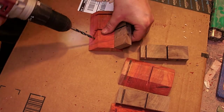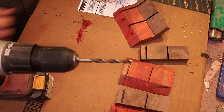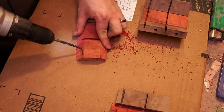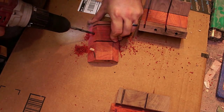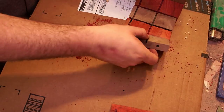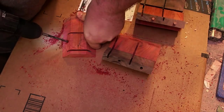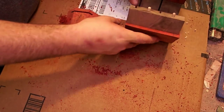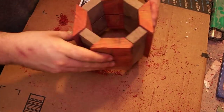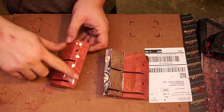Now that I have the slots and bottoms cut in all these little pieces, I can start cleaning them up and doing all the joinery on them. All the pieces of red heart were a little bit trickier to get the dowel pins at the right angle. They ended up with a decent amount of slop in them, which is probably good for clamping and gluing. I had a little bit of a problem with all my cuts being an accurate angle, and I think that was mostly due to how worn out my saw blade was. I recently changed it out and didn't really realize how bad my old one was. When I put the new one in, it cut so much better and the angles were much more accurate — I think my sled was moving around in the channels because I had to put that much force on it.